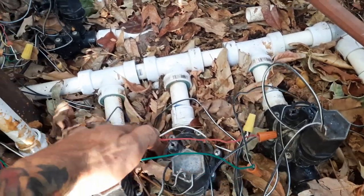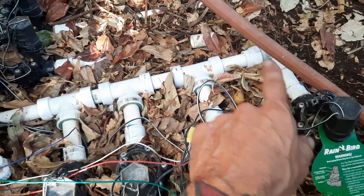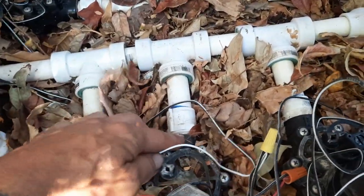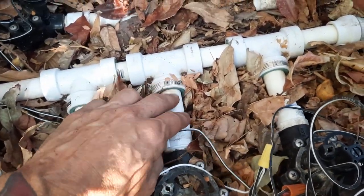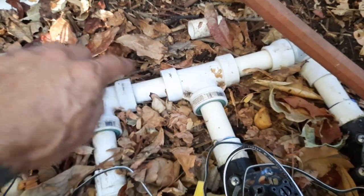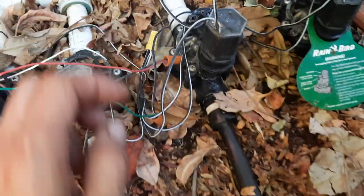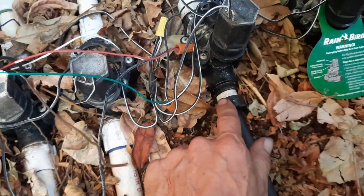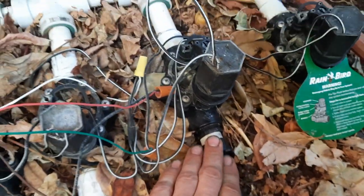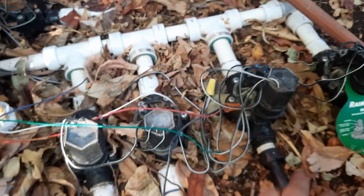And one stick would definitely put together this entire system, because you only need a couple small little pieces between each of these little parts. You want to give yourself enough room to, if you need to put a tool in there and take this off, that you can take these tees back off again, whether you've got a leak here or here or here or here or here. You can fix these now because you can see them. You can physically see them leaking or dripping, and you can get to all these parts and keep them all nice and clean.